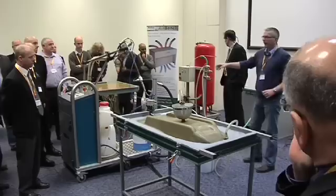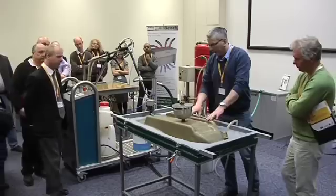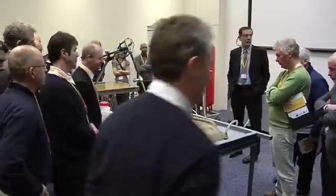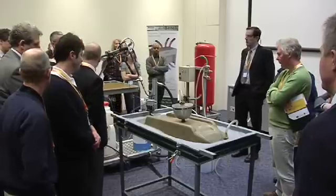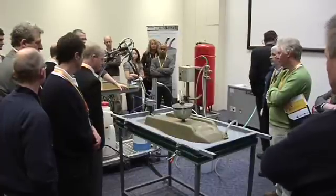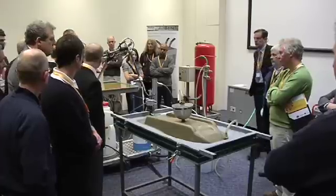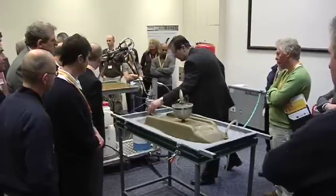Some of you can gather around because we've made the top of this tool a bit see-through and you'll be able to see the resin flow inside the tool. Because the machine has been sat here for a couple of hours doing nothing, we'll do a quick recirculation — pumping resin and catalyst from each of their respective stores up to the mix head and back again — just to make sure any air bubbles that may have formed while it's been sitting there get pumped through the system.